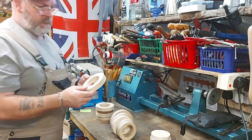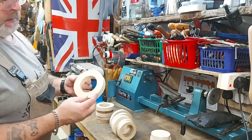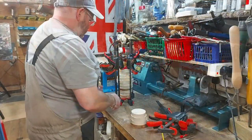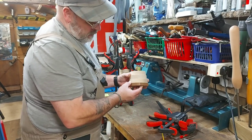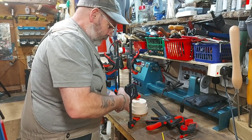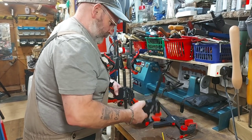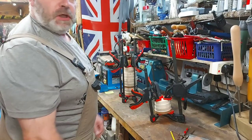What I'm doing here is just fetching the rough off on these, ready for gluing the surfaces together. Where I put the hole saw through, I'll just be lining all them up on the inside so they're nice and level and straight. We've got the main part of the rocket glued up, and I've got glue in between this end — so this is the nose part. I'm just gluing these up now. This nose part I haven't cut any holes in, leaving that solid to turn down.